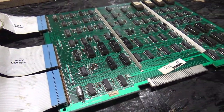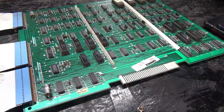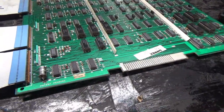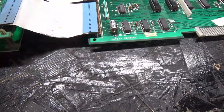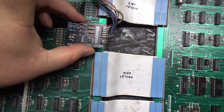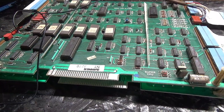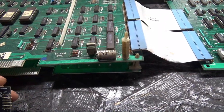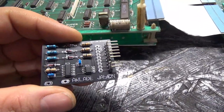I've seen that many times over the years and never really thought much of it, but a few weeks ago I said, 'Let me look into it and see if there's anything I can do.' I found a way to fix it — yes, there's a way to fix that line. I even made circuit boards that go right here, which allow you to remove the line on those MCR games. I did it all in one night — it's actually a really simple idea. I tested it and it worked.